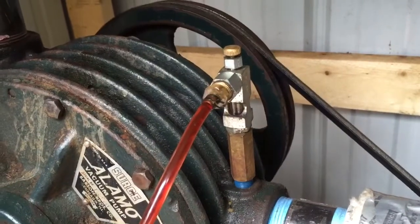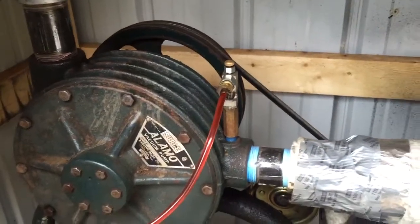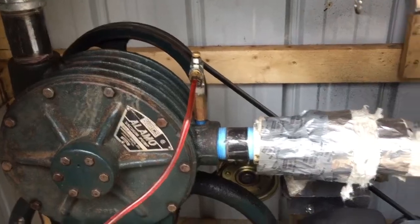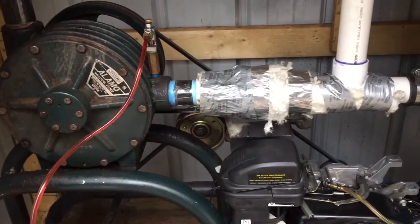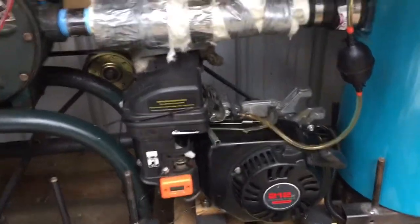From the oil filter there's a gas fuel line running into the oil dropper, and I have it dripping at around 80 drips a minute. The original manufacturer spec for the 30 Plus was I believe 40, but I think that was for 15 inches of vacuum and we're usually around 18.